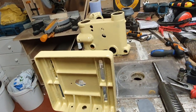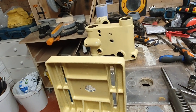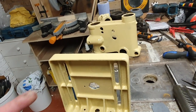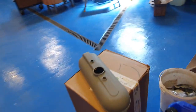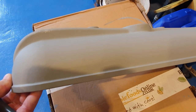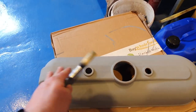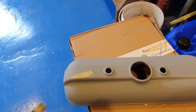It might not be obvious to everyone, but there's almost like a gray oxide — you know the red oxide priming paint — well the primer is called brushing primer gray, and that's gone on all the cast iron parts. Out here we've used an etch primer for the non-ferrous parts, which has chemically etched itself into the aluminium and really grabbed. It's a very solid primer and I'm really pleased how these have come out. These are also going to get a quick hit with a top coat in a moment — they're ready to go.